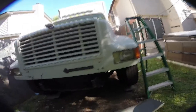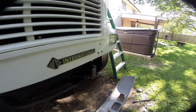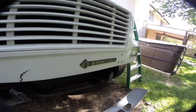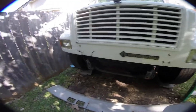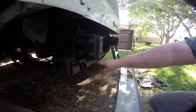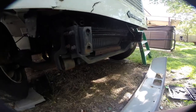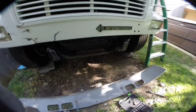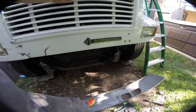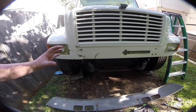The first thing I did was I took off the front bumper — it's just held on by these brackets right here, three-quarter inch head bolts, just pops right off. What we're going to do is use angle iron, take off these nuts, put a piece of angle iron here and likewise on the other side, run a tube across and put the receiver right in the middle. We'll cut out this bumper because it's just sheet metal in the middle, and that way it'll be tied in and squared off against the frame. Being a piece of angle iron, it's going to prevent deflection in either direction.